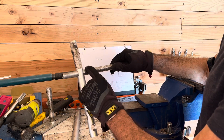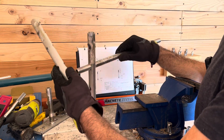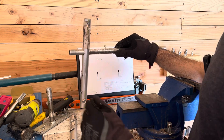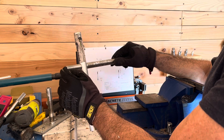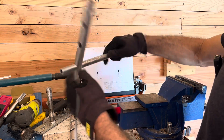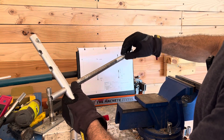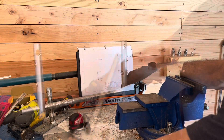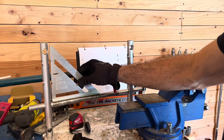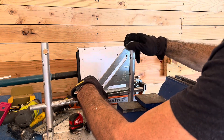So that's an inch wide, which means we have two inches left. We're going to have another tube that's about three to three-and-a-half inches long - it's going to thread on here, and that's what the swing arms are going to tap into, leaving us with an additional inch off the end. This one's five inches long, so if we needed to pull this out of the frame we could thread it all the way across, turn it a little bit, and thread it out. There's the first part of that frame tube being set up - that looks pretty square.